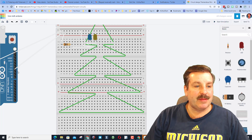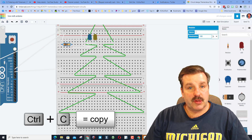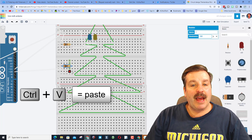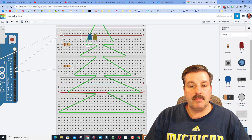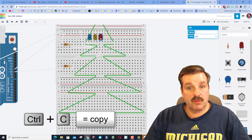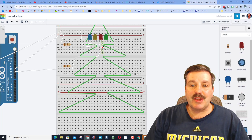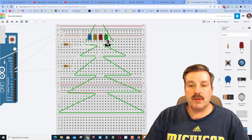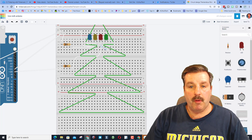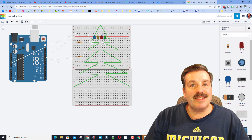Want more lights? Stop the simulation. Run a new wire from pin 10 out to a resistor — instead of grabbing a new one, use Ctrl+C and Ctrl+V to copy. Bring the electricity up to the next LED, placed in row 16, aiming for the anode. Copy the LED with Ctrl+C and Ctrl+V, place copies in rows 17 and 18, pick fun colors. The electricity goes out the cathode, across to the next anode — just be in the right row — then take it back to the negative row, sneaking through so it doesn't show up.